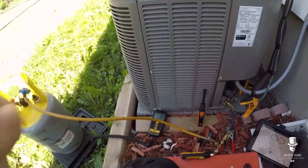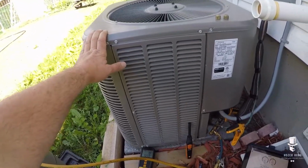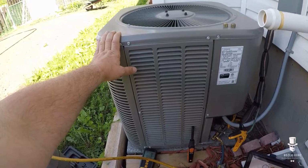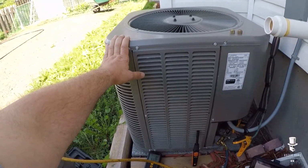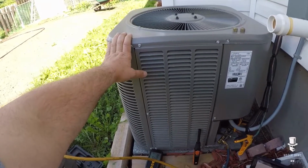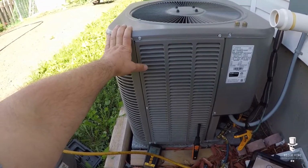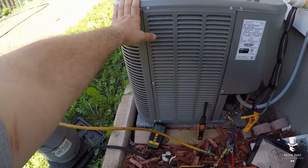I mean, the neighbor was complaining the unit was coming on and off, and you saw the airflow on there. I mean, it was cranked. So you're not really pulling out moisture. It's cooling sensibly, so that temperature is coming down faster, I would think. And now we're going to set it up the best that we can with the units that we're working with.